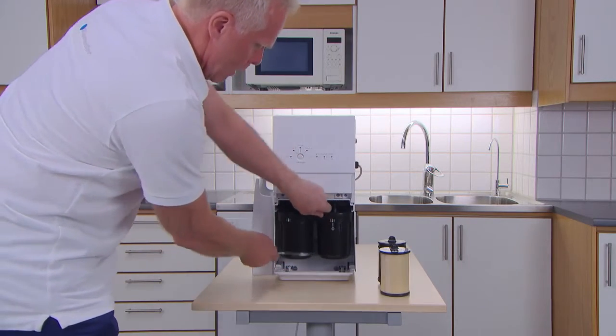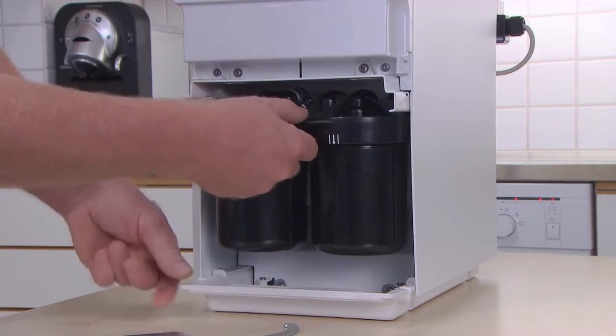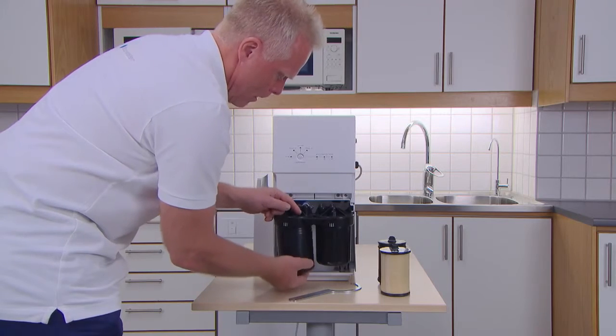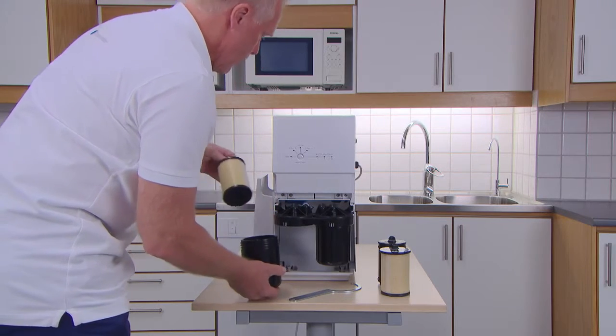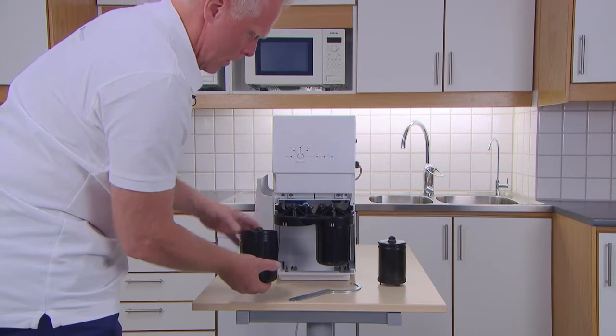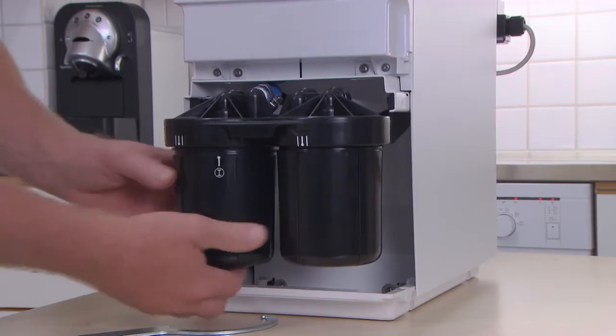The filter can stand inside the unit — pull out the slider. Remove the sediment filter and throw away. Ensure the O-ring is placed in its groove in the can before inserting the new filter, which you then screw back into the slider unit.